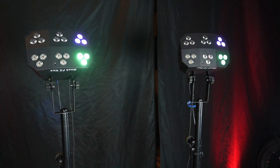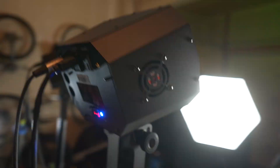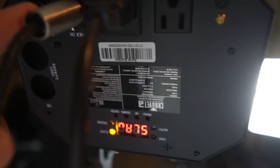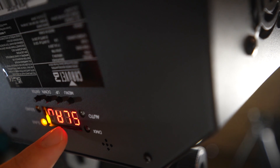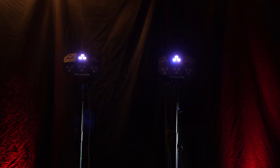Before the demo, let me explain the setup real quick. I have two of these on top of my gravity stands — the cables aren't super tidy since this isn't a gig, so please forgive me. I have them on master-slave mode. For the master unit, I have an XLR cable with the DMX out leading to the DMX in of the slave unit. I have the slave set to slave two so that they mirror each other — that's really nice. I also have the intensity at about 40% power, dimmed down on the master, just for the demo so you can see it without it being a big bright halo on my camera.